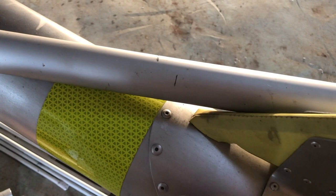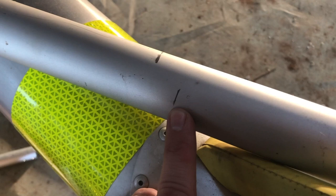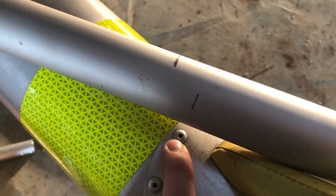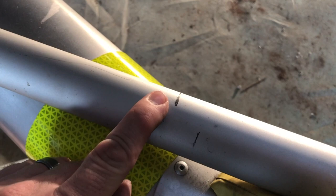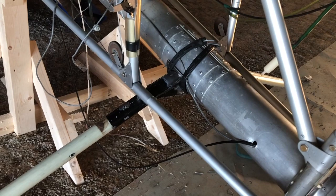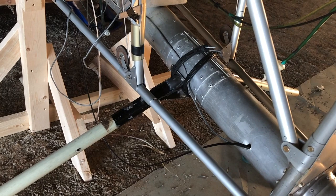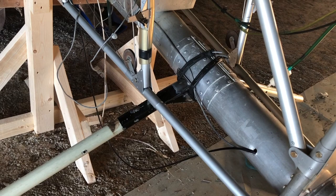I did make this mark. I can't find my Sharpie today so I used a pencil, which is typically a no-no when working with aluminum, but this is a scrap tube so I don't care. I made a pencil mark to align with the center point of this rivet — the mandrel hole. You can see on the other side when I measured the right gear I had the mark there. So obviously I'm a little bit off, and the bungee arrangement I have going on right now to temporarily hold the saddle in leaves a little something to be desired. I think before I break one of the tacks and try to rotate it a little bit, I'm going to clamp it with better clamps first and we'll take another measurement.